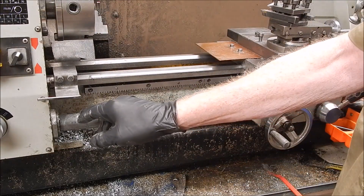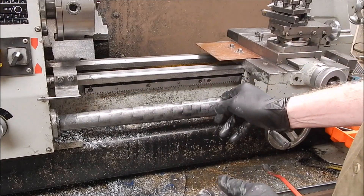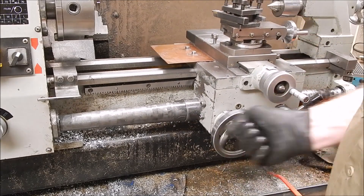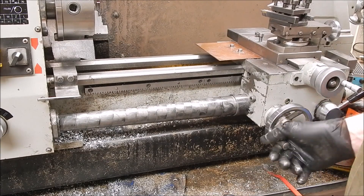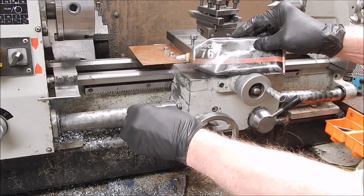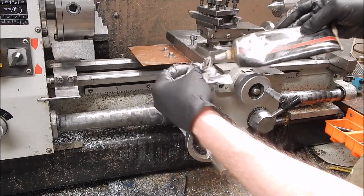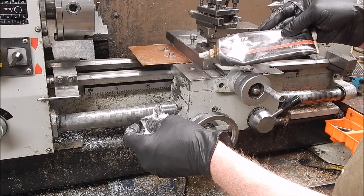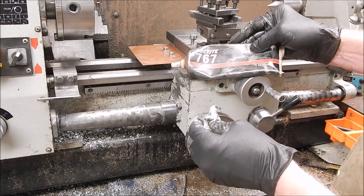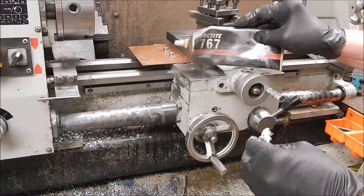The other thing with these covers is you've got to oil them. When you oil your ways with the oil can, run some oil along the covers as well so that the coils will slide over one another as it compresses. These are metal. Anyway, that's my tip — Loctite 767, but only for covered areas. You can use it on gears, like for your carriage drive, anything like that. Just make sure you're only using it in areas you're not going to come in contact with, because it makes a hell of a mess otherwise. But it certainly stays in place — it's very, very good at that. OK, that's it. See you next time. Cheers.